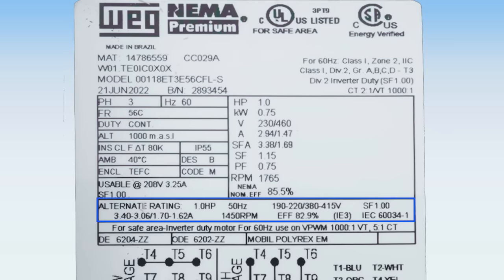This particular motor shows 50 hertz alternate data. Most three-phase motors will work fine on 50 hertz or 60 hertz. The nameplate may indicate this and show the available voltages, the full load amps, and the speed for 50 hertz. Be aware that some motors may have lower horsepower ratings when used with 50 hertz. It is less common that a single-phase motor can operate at 50 hertz, so be sure to check the nameplate or the specs.